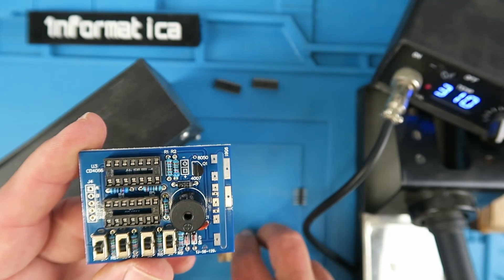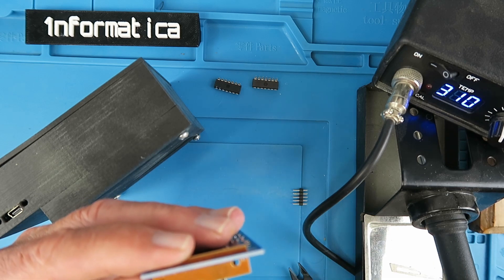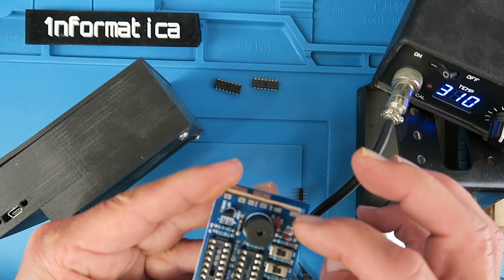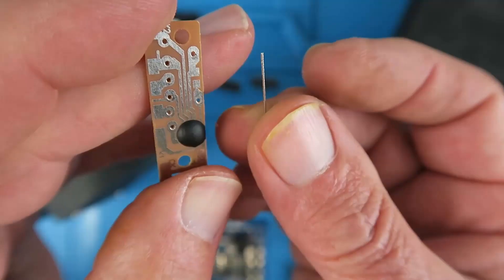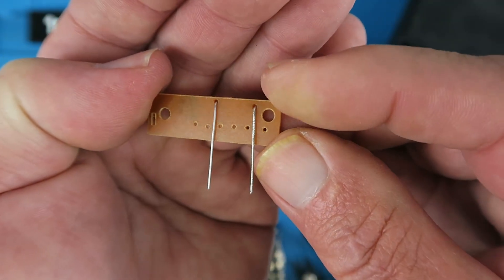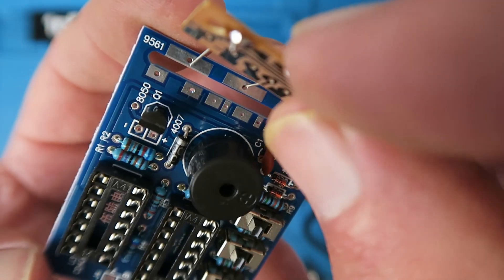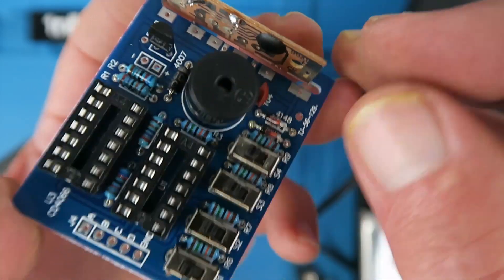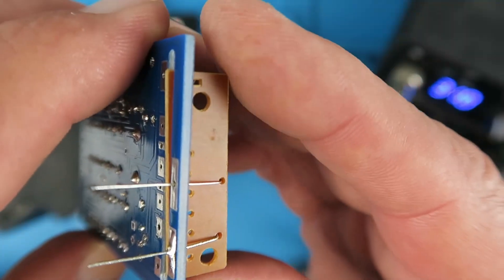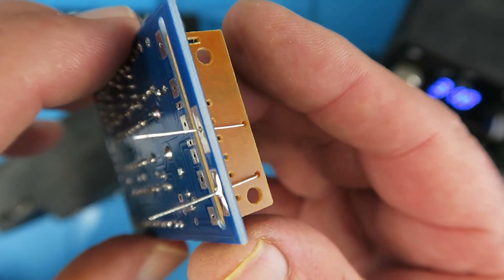Now we can turn our attention to the little module. The best way to fit this I think will be to put a couple of wires down from the two pins at the top into the circuit board, and use that to hold it in place while we put little solder bridges on the side. For connecting I'm just going to use a couple of the legs cut off the resistors — you can see the idea more clearly, just to put those through there. There's nothing on this side of the board to short out, and that now will fit into the holes there. We just want to adjust it so that it's level with the underside of the circuit board.